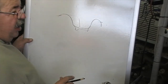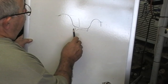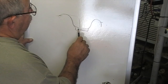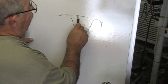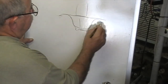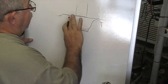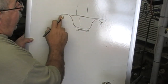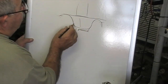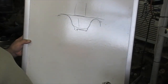So we don't have much to work with — about an inch and a quarter deep, a little bottom and all. I'm going to do this bottom first and shape this first. Then I'm going to take it off the glue block. I'm going to shape this, then put a receiver here for my chuck, open my chuck into this as we turn it around, and then shape the other half. The goal is: put the receiver in, set this bottom, arc these two wings out, get them where I want them, and get it finished so we can turn it around.